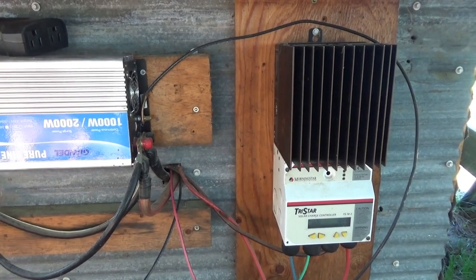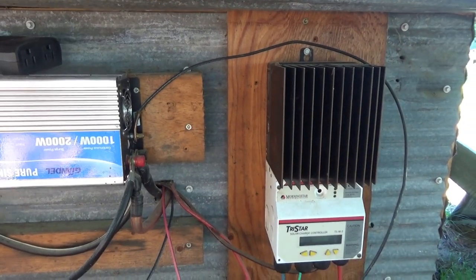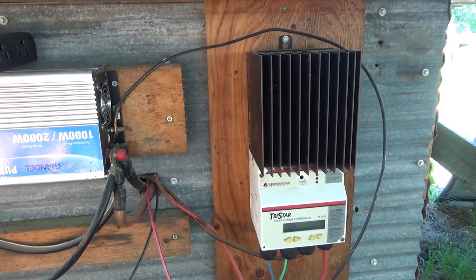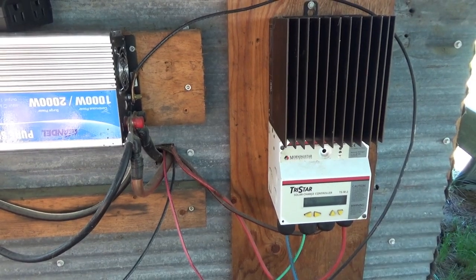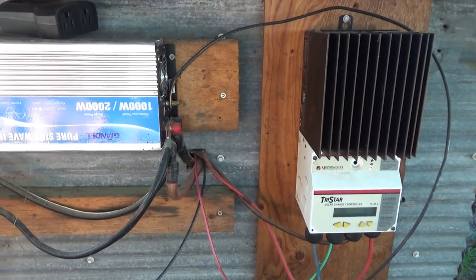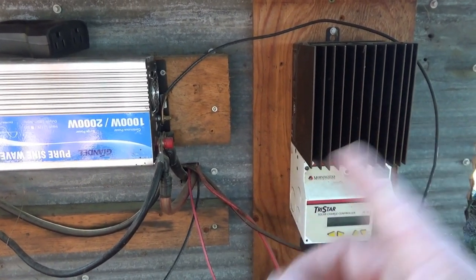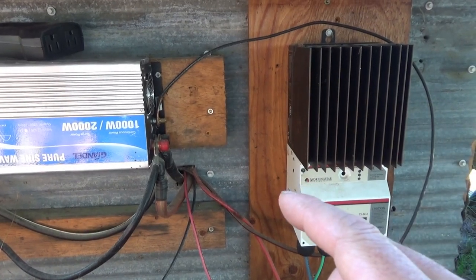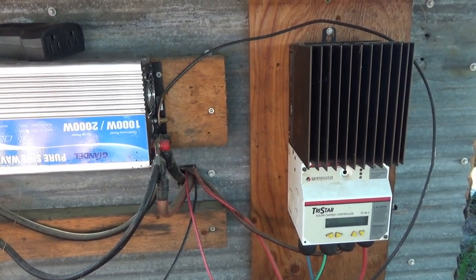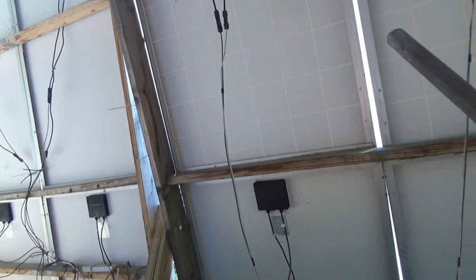For the water pump I'm going to need another power inverter just for that, and more batteries. But I still think we have enough solar panels, because the most I've seen us draw continuously — when we flipped fully on the grid and checked via the digital meter — our peak continuous output was a third of a kilowatt, so 300 watts. With this many solar panels I believe we could go fully off the grid.